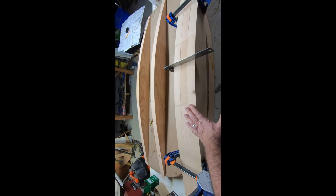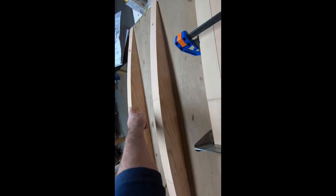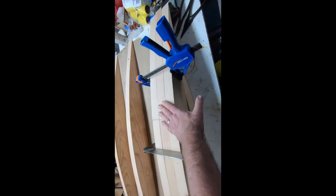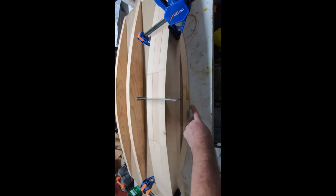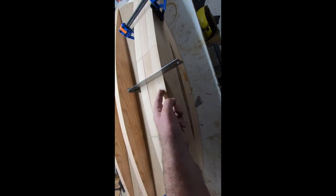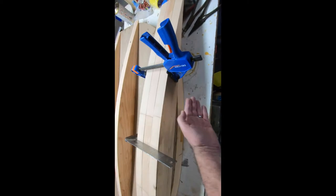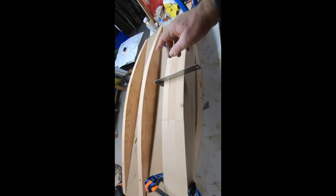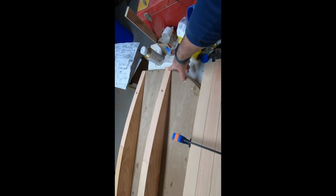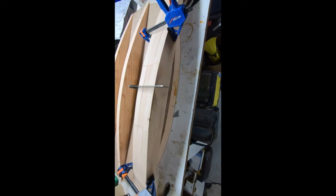Here are my last three pieces to be cut, and I'm very pleased with them. I smoothed these off with my sander — these are 90 degrees because the scarfing of the wood is at 90, so they match up and are all nicely faired curved. Now I can see the 12-degree cut that needs to come in, and I've got to cut those in at 12 degrees. That can only be a lot of planing all the way around this edge to get it curved that way and sloping in. They don't tell you about this when you come to buy the plans and build a barrel back.